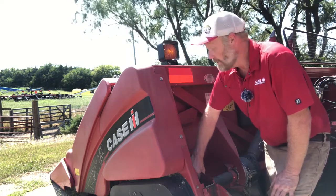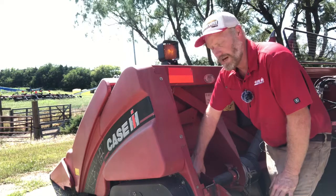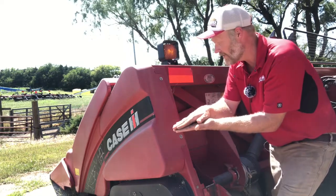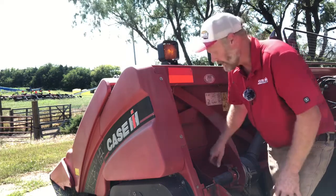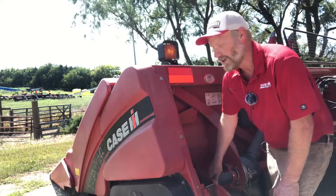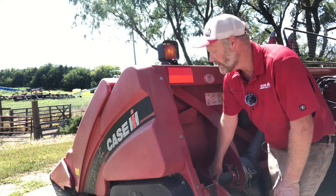And then what I typically use to raise the auger is I've got a porta power with the wedge on there. I'll slide that wedge underneath the flighting on either end and use that hydraulic wedge to raise that auger up until I can slide an ear between the flighting and the trough of the auger, and then I can lock my bearings back down.